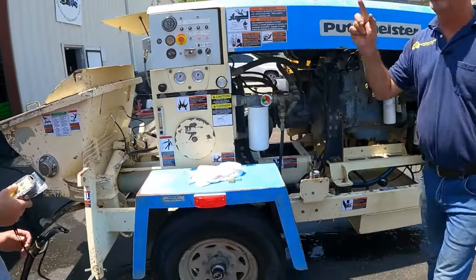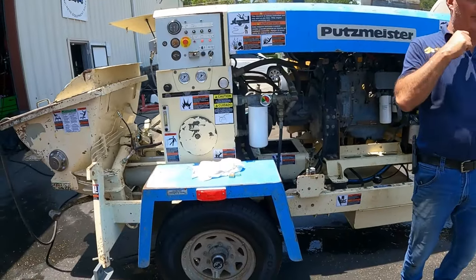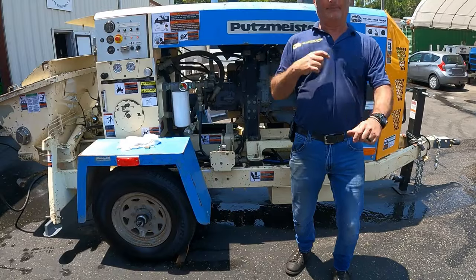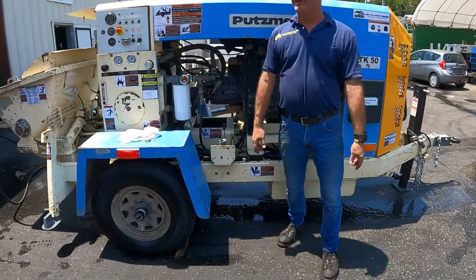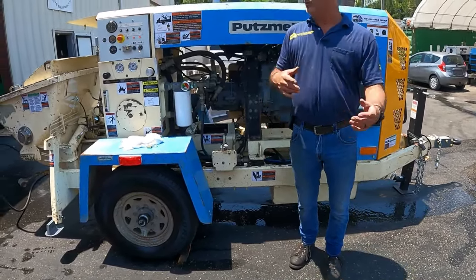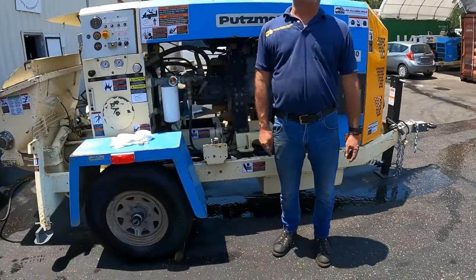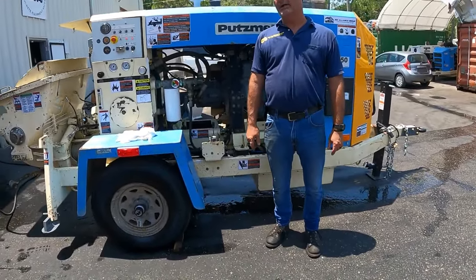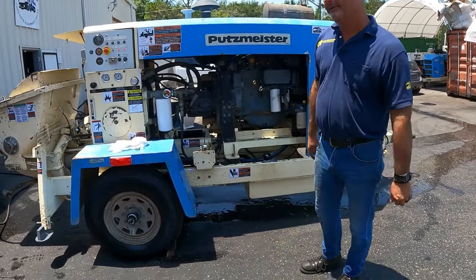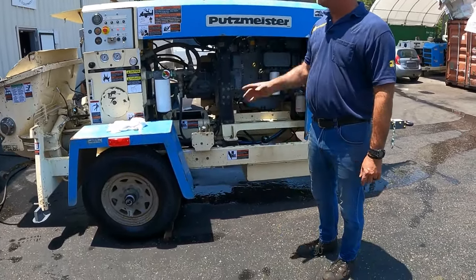Usually when they're pumping, I see them on their tippy toes, I stop. I do that all day long. You don't want them constantly working back, it's just too much for them. As you bust a hose off, of course, they get on the flat of their feet. Well, I go back and turn it up, because if you're not on the tippy toes, you're not gonna make much. You're probably in the 20, 25 yard an hour range if they're not on their tippy toes. On the tippy toes, they're usually about 30, 35 an hour. So that's about where I put them.